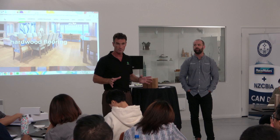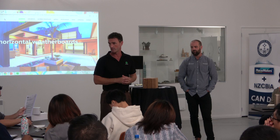Pine, for instance, is around 55 plus as an allowable paint finish light reflective value on a job. The council are getting a lot more strict on this, and they're asking for manufacturer's sign-off. I recently had a job that was at a 17. They finished the job and asked me to sign it off. We cannot sign it off. They cannot get coated twice because their paint is now at 17. It's too low. No one can sign it off. So they can't get code of compliance, they're struggling for insurance, it causes all sorts of issues. So talk to us about it.